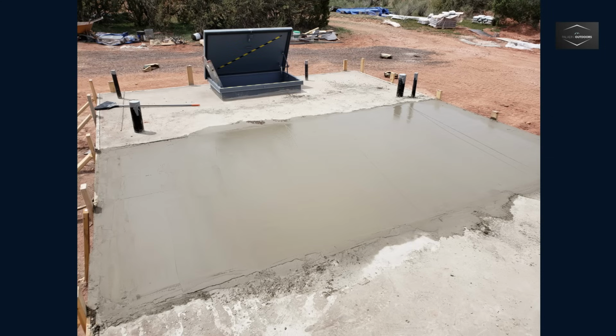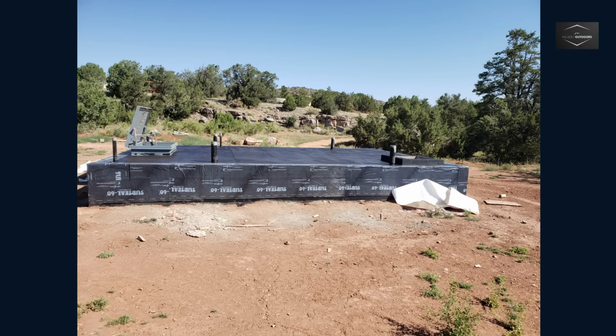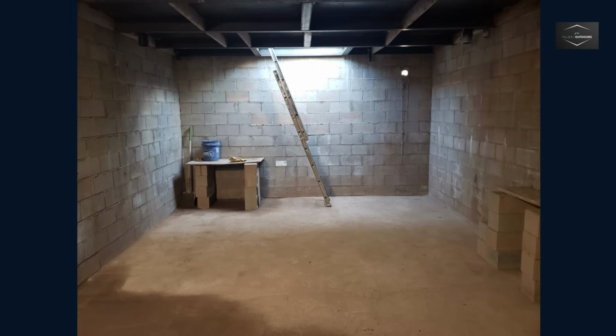It is important to keep in mind that not all curing agents create a waterproof finish. Cheaper ones will generate a wax-type coating that will wear off with time, preventing the immediate application of a waterproofing agent but leaving the concrete vulnerable. The last step was to apply asphalt emulsion to the concrete to prime it for the waterproof membrane that would be applied after. With the concrete finished, I could finally admire all the work.